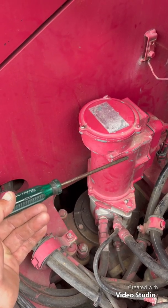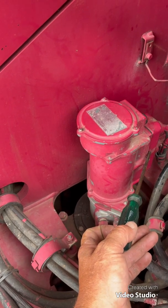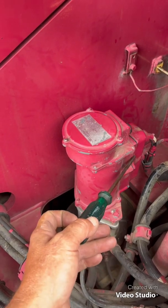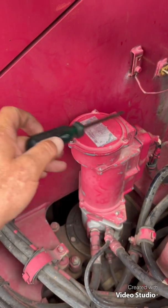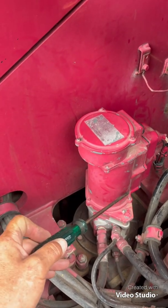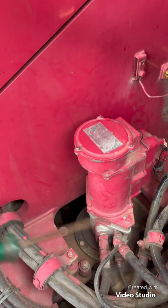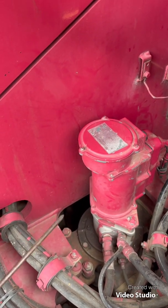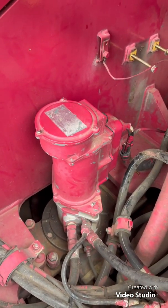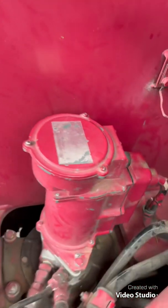This unit has rings in it — a whole heap of them — and then in the back you've got contacts or brushes that rub up against those rings. This top housing spins with the top of the superstructure, but inside, the discs stay stationary. That's how we do 360-degree slew without all the wires getting tangled. It's a pretty common thing on industrial applications where something spins and has electrical current going through it. Anyway, that's our rotary brush set.